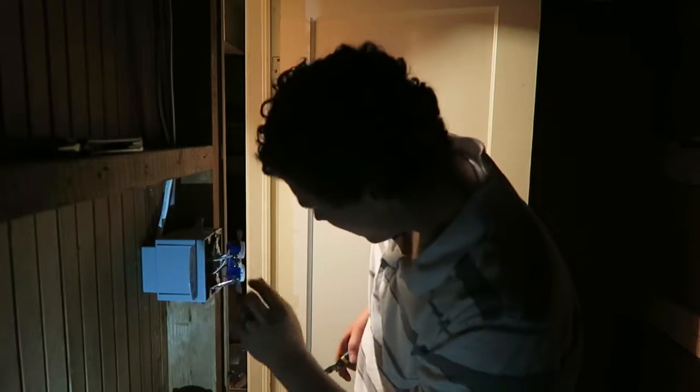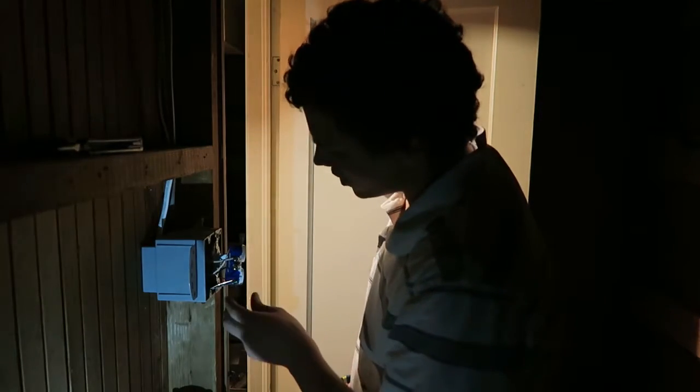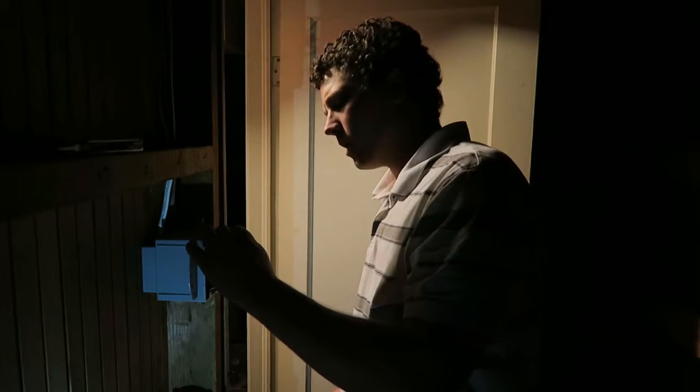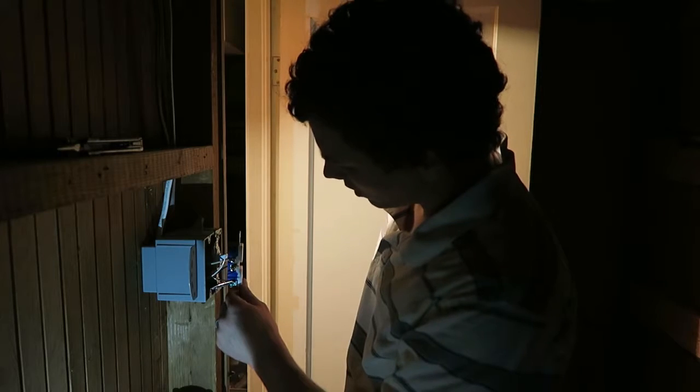Okay, we strip off this white. This outlet's already wired. I've already got a white one on this side. I can either push it in the back or I can use the screw. It's already got a connecting plate there, so it will be constant. And the white is also the more silver screw. The gold, I remember it, black gold. So black wire goes to the gold screw, white goes to the silver or more white-ish color, and then the ground goes to the green.